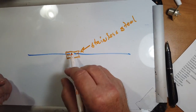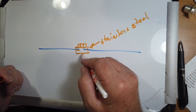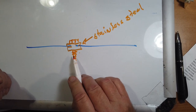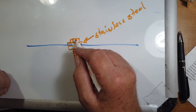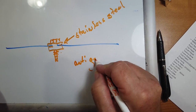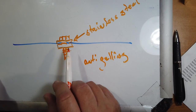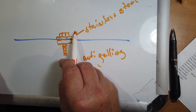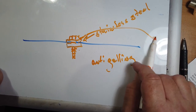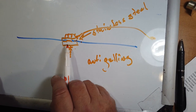Don't use aluminum — stainless steel is more expensive but the right choice. Put a bolt down through the bottom with a stainless steel nut. Now note that these can tend to seize, so there's a chemical you can put on it called anti-galling — G-A-L-L-I-N-G. If they gall, they become very difficult to take apart. Then you put your strap, whatever it is, under here — copper — and take it over to the next one and do the same. That way the copper touches the metal roof only through the stainless steel.